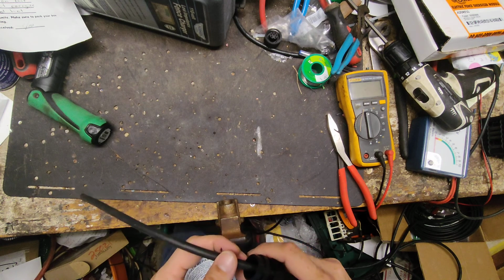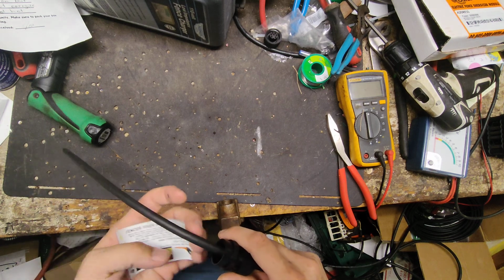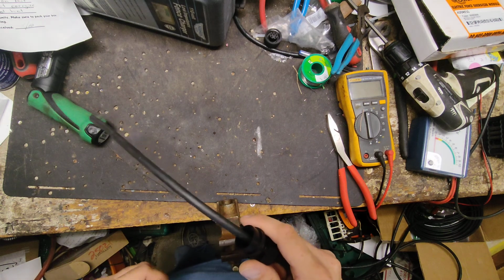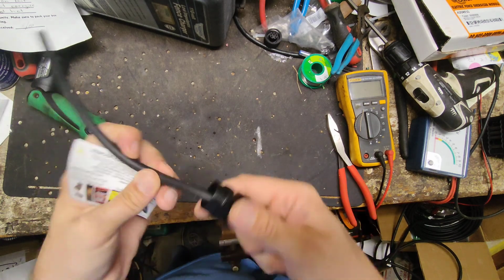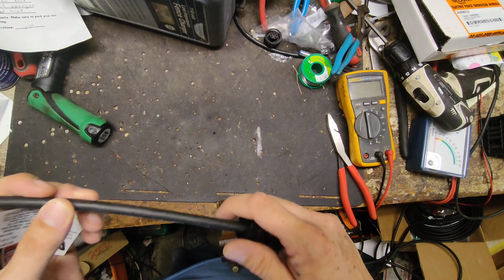I've heard people doing that, and then like 6 months later, or the next fall, or next summer, they call me up and say, hey, I did this stuff here, and it's not reading right, and numbers are jumping all over the place. It's because of urine and manure, or the connections got wiggled around, and now he's got trouble again. So I would solder and heat shrink it all together myself.